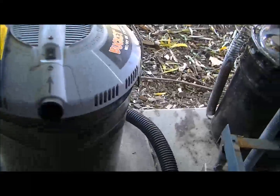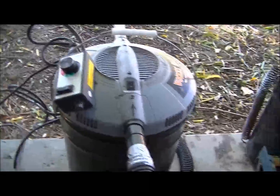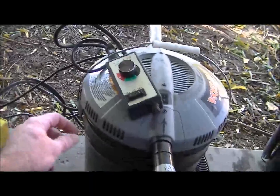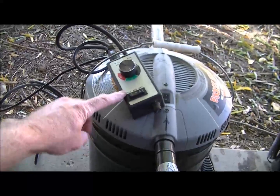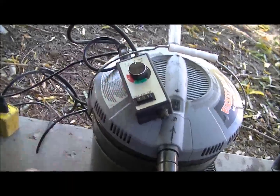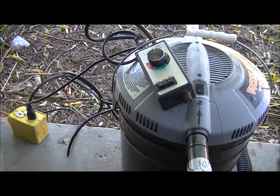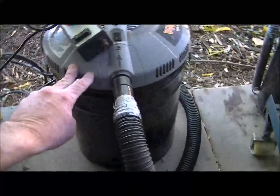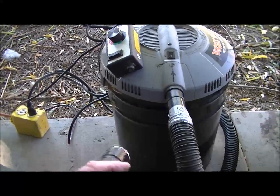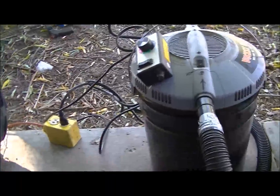Because this is a vacuum, it's got way more velocity than I need to run this gas fire. So I went to Harbor Freight and got basically a Variac — a router speed control — so you can turn it on full or variable speed and adjust the speed of the vacuum. Even on low it's still more than I need. Some of you may be saying you're running flammable gas through a vacuum — well, the motor is sealed from the fan blade, so there's no gas that actually surrounds the motor. It's just the impeller on the vacuum itself.